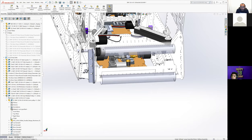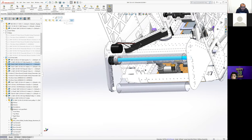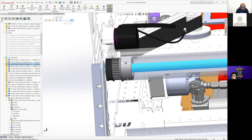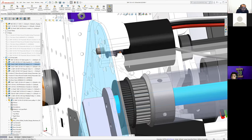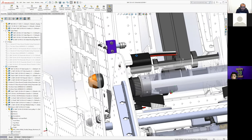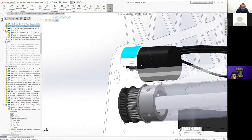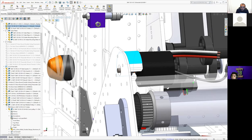So these inner 7/8 tubes, just like our 2019 intake, they don't rotate at all. They just have star nuts in the end and are bolted into from the side panel. And so all the rotation is done just on top of them. Our intake was powered by a Neo. It's not translucent either, so it's easier to see. So yeah, we have the side plate and we have a 3D printed spacer block here that allows us to mount into the Neo through this spacer without having to have another sheet built up.